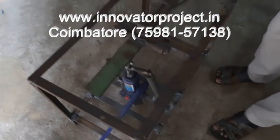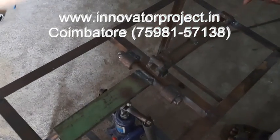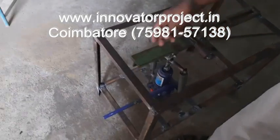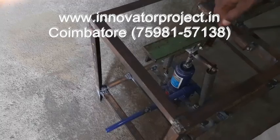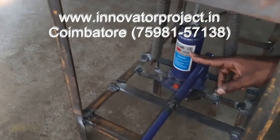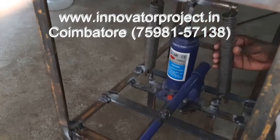Then this is the guide arrangement. These are the guide and 12 mm square rod. In that we are going to put the TMT rod. Then this is the hinge mechanism, an up and down motion hinge mechanism. At the bottom there is a hydraulic jack, a 5-ton hydraulic jack. These are the springs, 30 mm springs for return purpose.